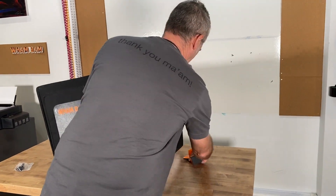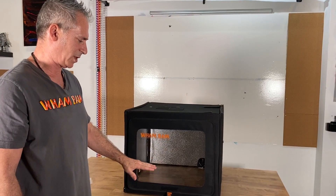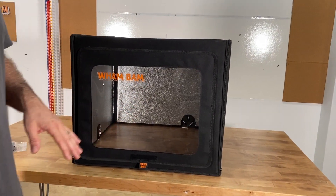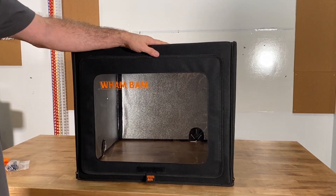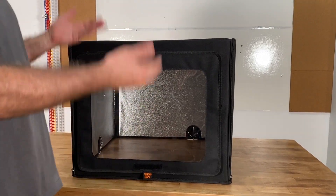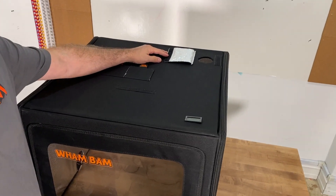Others would like it to get over the top of a higher machine. With heat rising inside the chamber, even if you have a cool area at the bottom, it's not going to affect your ability to keep the chamber hot. Usually if I'm printing a hot material like ABS, I'll heat my bed to 130 degrees, get the enclosure up to about 40-45 degrees ambient temperature, and then crank my bed back down to my printing temperature. If I see that temperatures keep rising, I can use the top flaps and leave them open to regulate airflow.